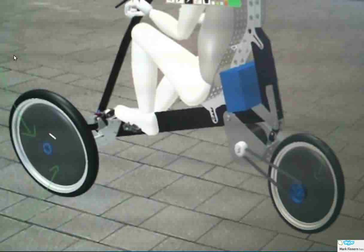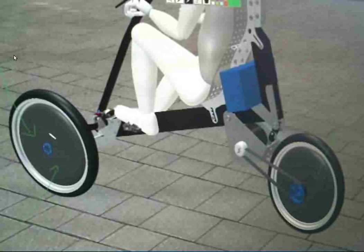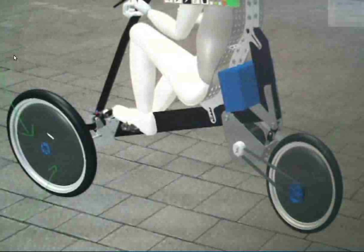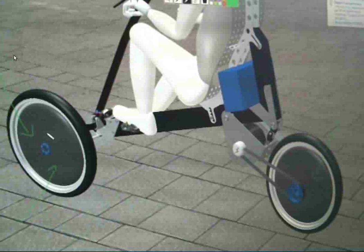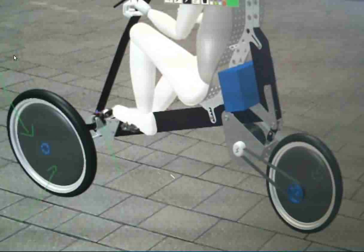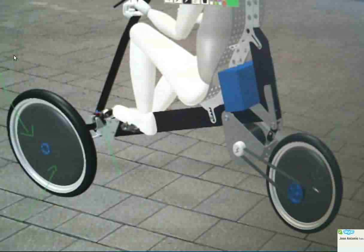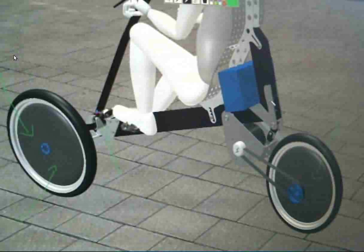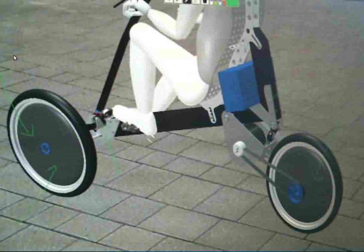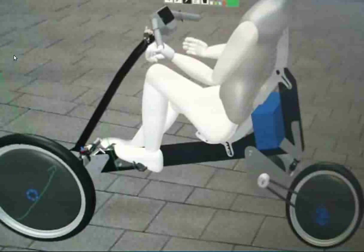I need to do another finite element analysis because right now it's five millimeters of aluminum plate — I think it's strong enough, but I want to be sure. There are lots of glitches you don't see: screws are not in the correct place, the seat I think I'll have to make stronger. The tilt lock is not implemented — basically it's a small piece to add, and a small mechanism to add here.